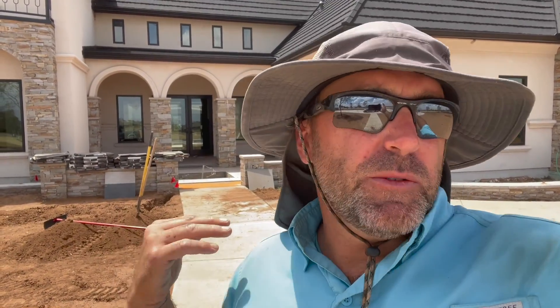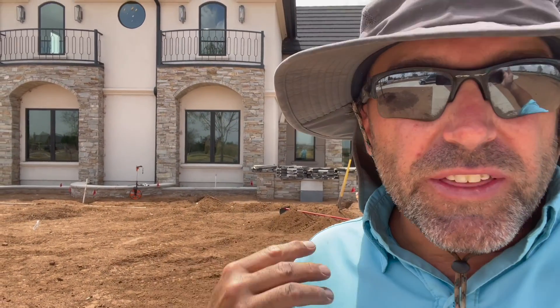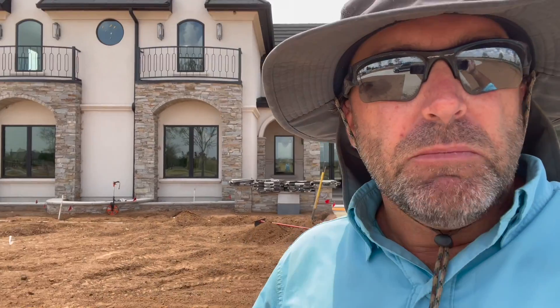Here's the thing we're looking at: this little door right here isn't the front door — it's a side door that goes into the master suite of this house. They're going to be using this sidewalk every now and then; they may not use it a lot because they park in the garage. But this is the king's area. The last thing you want is for the king to be walking right here and see a valve box right outside his walkway. That's just my opinion. So you need to think about these kinds of things when placing your valves. That's why I like up here in the corner by this window. The only thing I don't like is that seems to be like an office — I don't know if he wants to look out the window and see a valve box right there. But that may be the best place versus right down this sidewalk. Change your design, move your valves around, and make them a little more inconspicuous. It's going to bring your design and your installation up to the next level.